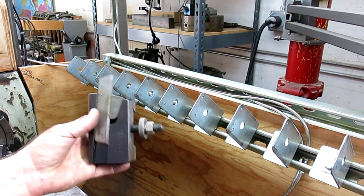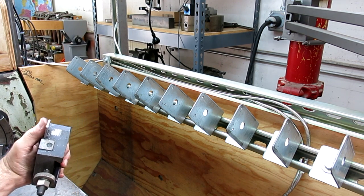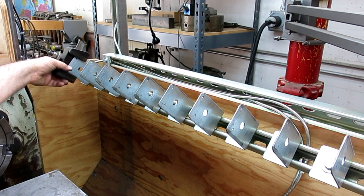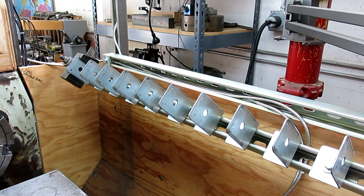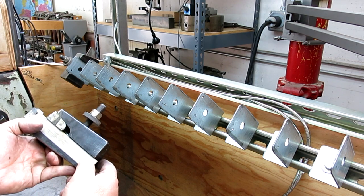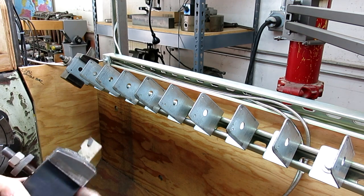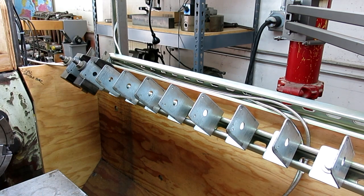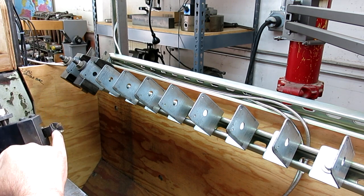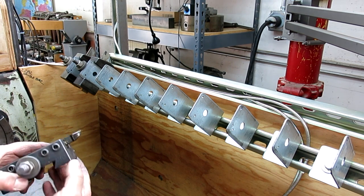So this is just a high-speed parting tool. I like this for plastics and stuff like that. High speed, you can get a little sharper and a little less pressure. Let's put it there. Okay, next one. This is an ISCAR self-grip, and it's a retrofit for an Aloris holder. Works pretty good, the self-grip tool, and you can just pop the inserts out. It's good for deep parting. Next one, another ISCAR tool, another self-grip, but a little skinnier. And it's in a fixed holder, and this is good for tubes and small diameter stuff.